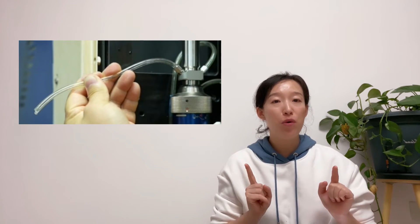First, check whether the water circulation for the fiber cable is blocked or the volume does not meet requirements. We can turn off the chiller first and then remove the water hose of the fiber cable to check the outlet water volume.